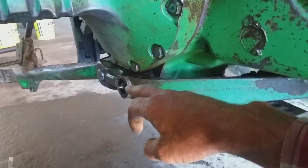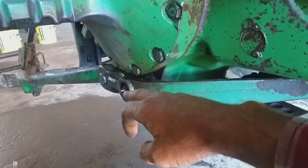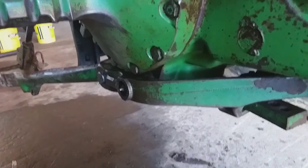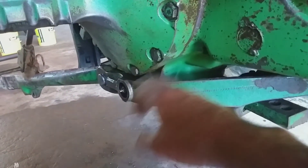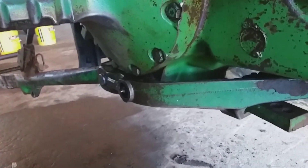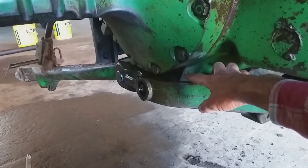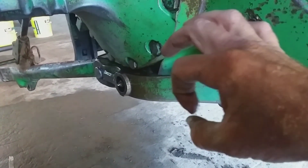To fix it, all you do is take out a clip ring on this side and the other side — pressure wash the mud out of the way first — and then the little end caps will slide out. You may have to tap from either way. You just slide the shaft out and there'll be some o-rings on the inside right here: a rubber o-ring and then a plastic o-ring, and they go around the shaft.